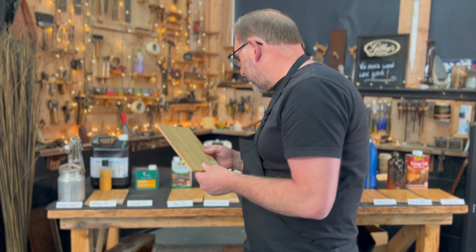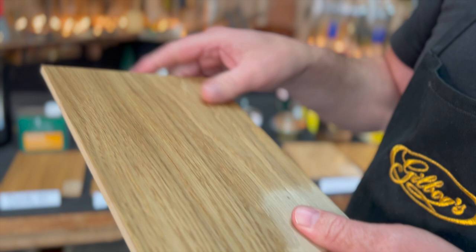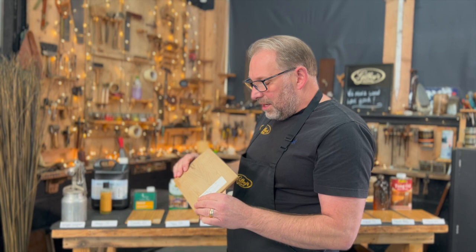The orange oil or mineral oil finish — that's going to give you no protection whatsoever. It's soaked into the surface and it seems to have dried, but it's not going to offer you anything — it's just been absorbed by the wood. You could wax over the top, so it's a bit like a sanding sealer but takes a long time to dry. And then obviously we've got the lacquered finishes — spray lacquers like melamine, pre-catalyzed finishes, and the polyester lacquer with those thick, high-gloss piano-style finishes.